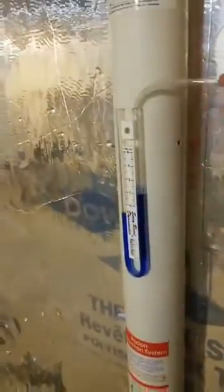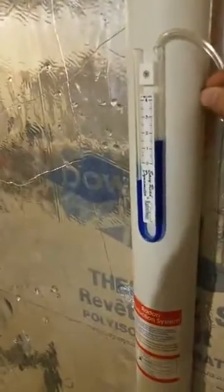So you have the pit — they put plexiglass over it to seal it. This is the meter that just indicates that there is pressure in the system, that the fan is running. So if you take that out, you can see that it goes to zero. So if you ever see that at zero, it means the fan is not working. That's all that is. This does not indicate the radon level in the house.